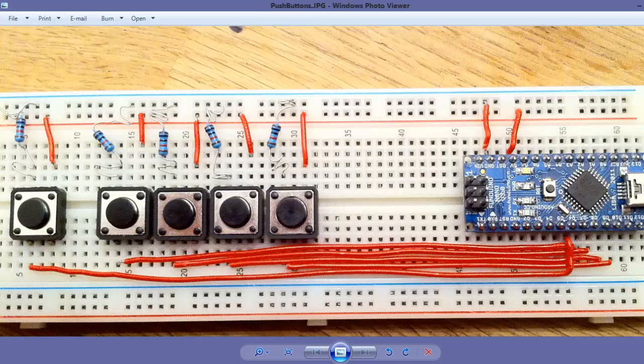This is how I have already connected the buttons. This button here is connected to digital pin 6, and the next one is connected to digital pin 7. This one to digital pin 8, 9 and 10. This one goes to ground and this one goes to plus 5 volts. Plus 5 volts go here to 5 volts, and the ground with 10k resistors go to ground.